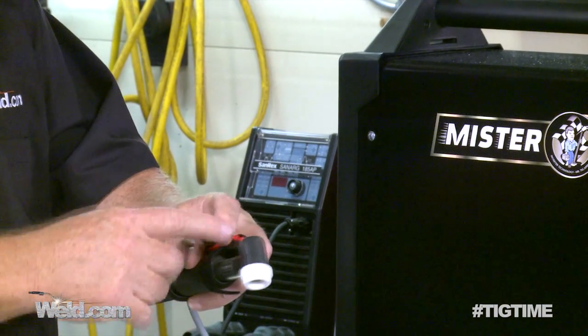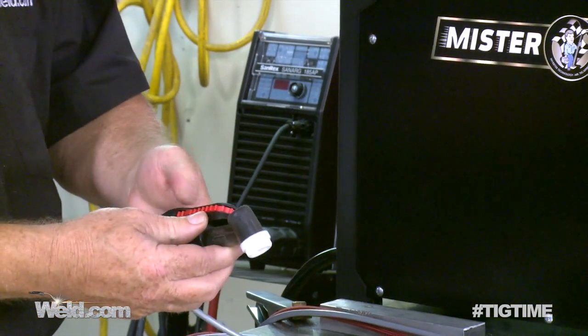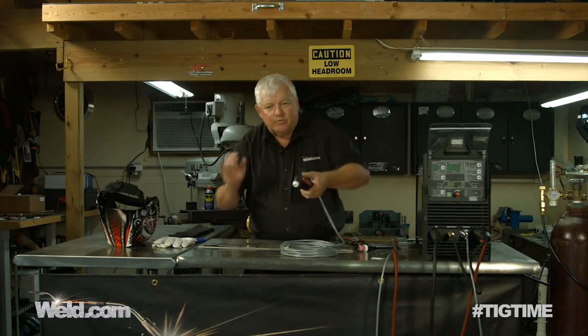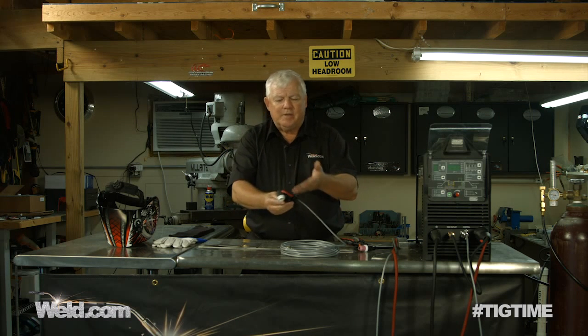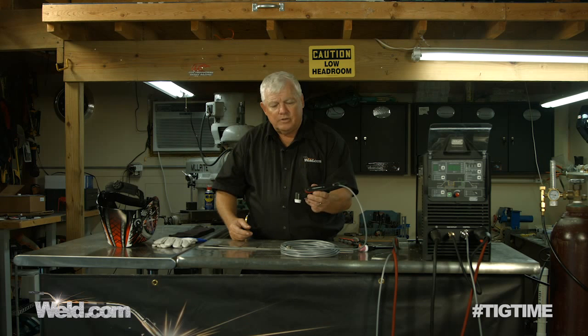You see all kinds of little techniques. There's one that's got a little roller on it, whatever your preference is. There's another one that's got a slide on it where it slides up and back. This is good for pipeline welding and certain types of welding, but it's not good for real fine work, manipulating around tubes. So this is my favorite right now, and they call it a race track. It's made by CK Worldwide, and you can see that you can adjust and rotate, but it still has a little bit of a lunge to it.